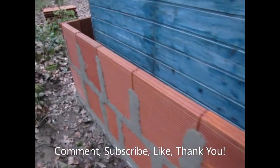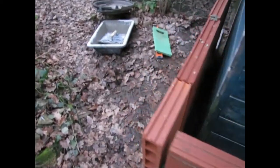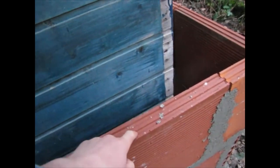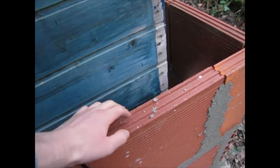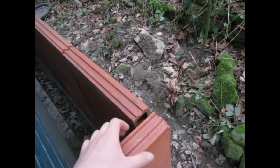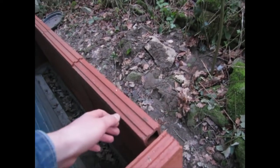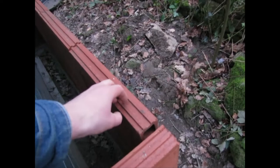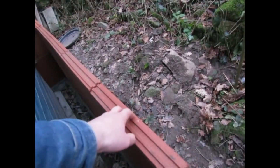I got the entire back done and this side done too. And I got four more blocks laid. Here's a little tip for those of you who decide to use these blocks: make sure the one with the more rigid side is on the bottom. Well, I think it's looking pretty good.